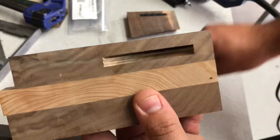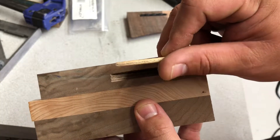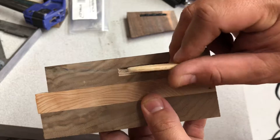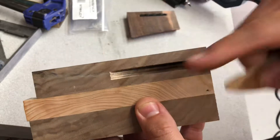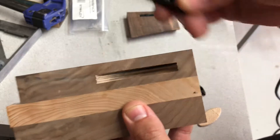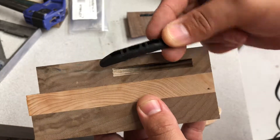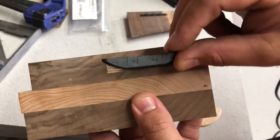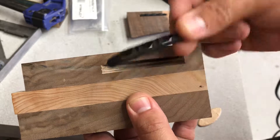The other thing you have to be mindful of is that your standard biscuit is about 4 millimeters in thickness. I'm not sure if it's a standard equivalent that's close or what, but the slot for the Mini 60s is actually 7 millimeters. They do make a router bit for it, but I'd really love to use a biscuit joiner if possible to simplify things a little bit.